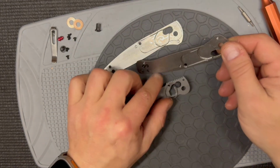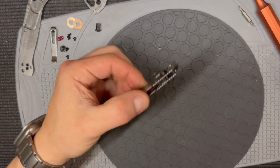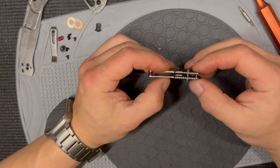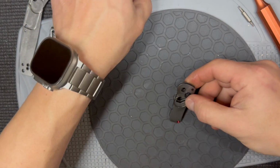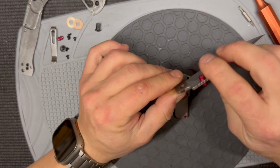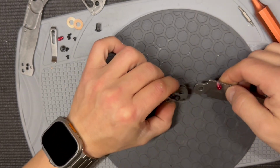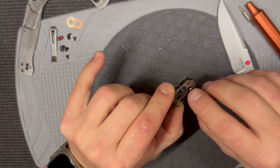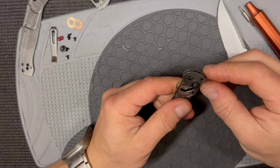We'll wipe it off in a little bit. Maybe not. All right, let's hear if this makes the noise. So apply a little pressure. No noise. I'm examining the blade now. No, this is pretty high finish here. All right. So why would it make noise? Ooh. I see a little bit of a burr here on the edge of that detent. Same here. That's not a good thing.